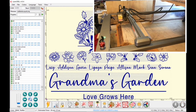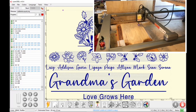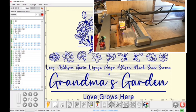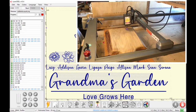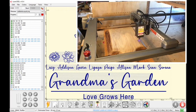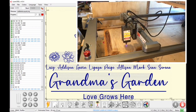I double-check here and do another frame just to make sure my charcuterie board is nice and straight, because I put a lot of work into sanding it down and I do not want to make a mistake. My next steps are re-jogging the laser, resetting the origin, and framing again so I know that my artwork is exactly centered and where I want it to be on the board.